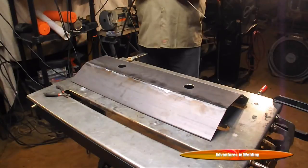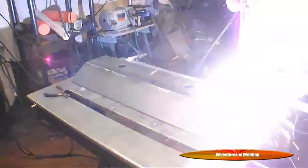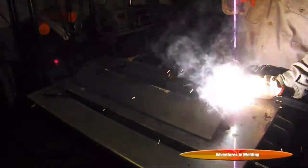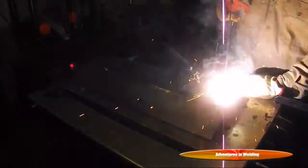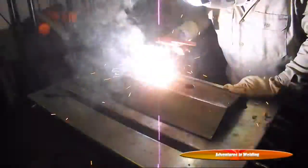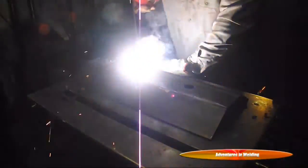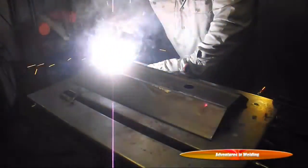In the spirit of keeping things mixed up and interesting, we did the first weld with the MIG gun and we're going to do this second weld with some low-hydrogen 7018 — this is 3/32nd, about 80 amps. You might say that's a little much for this metal but it's going to work out just fine. I've sped this up considerably for your viewing pleasure because nobody likes to watch someone drag a 7018 along a seam. It's a straight drag — you can watch the hand feeding down. Before a restart, you always want a nice clean restart. Keep yourself as steady as possible, run a nice straight line, build up a puddle about the size of a penny and move on.